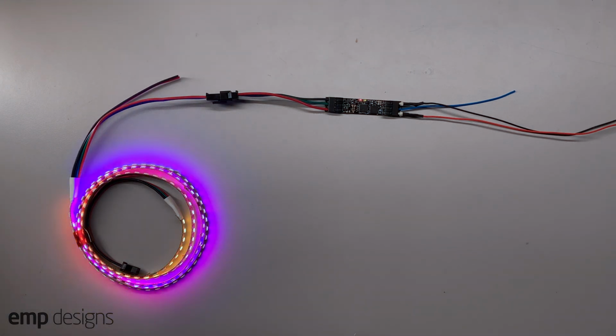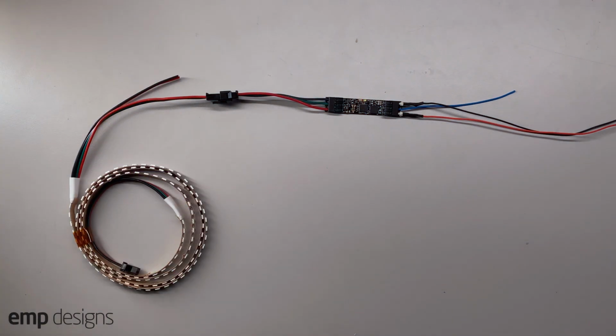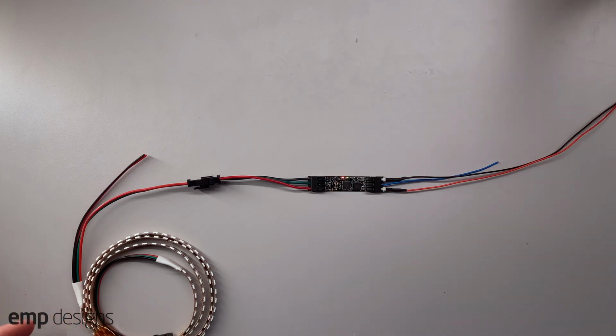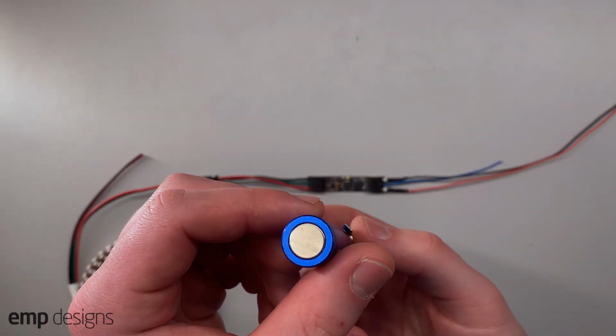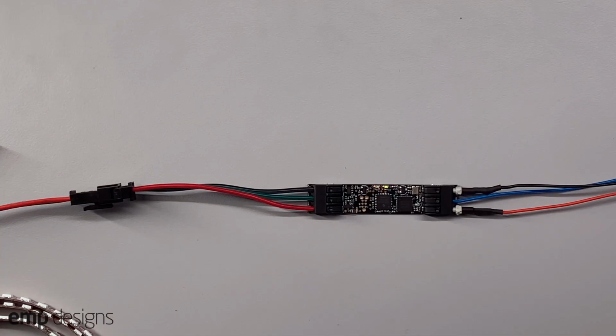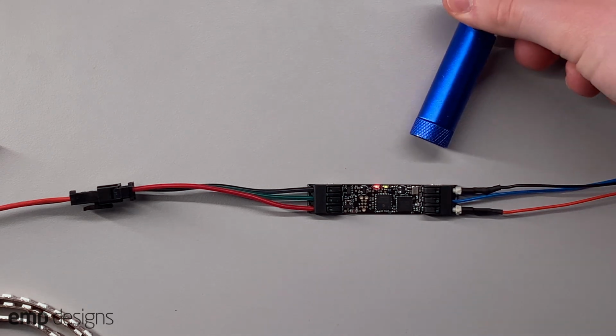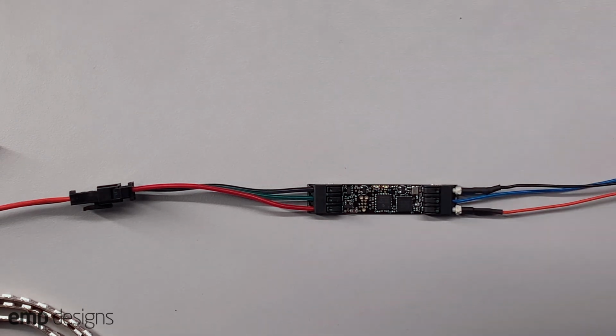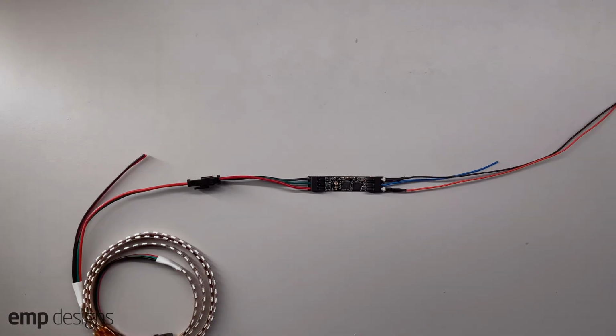Last thing to cover now is our two magnetic sensors. These are located beside each LED, and the one on the right will desync our controller, and the one on the left will initiate our one-touch addressing system. All you have to do for either of these tasks is hold a magnet next to the sensor for a few seconds. We'll know if desyncing works as a green LED will go out.